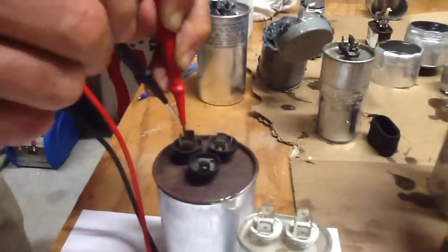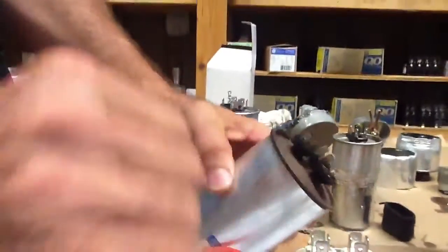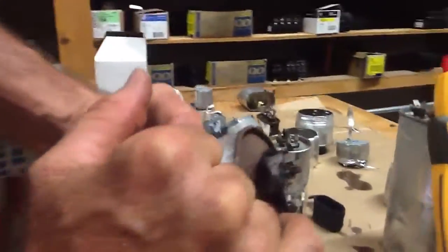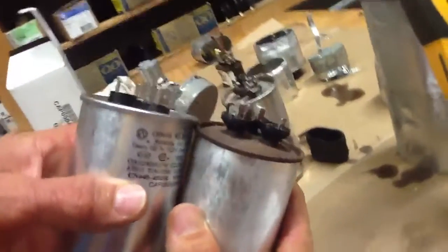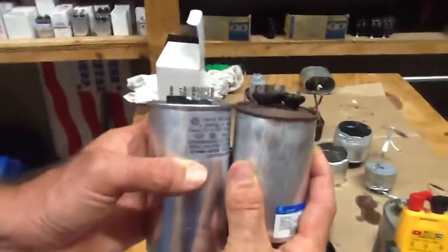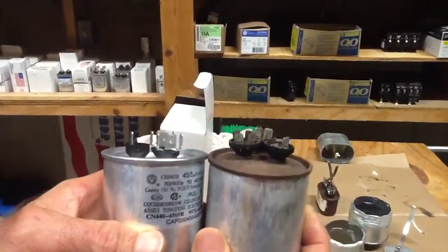Let's just check common to fan. This capacitor is bad also. I want you to point out it's swollen just a little bit — I'm going to do a better video later, but this capacitor is slightly swollen compared to this one. And that's just one of the things you look at when you're a service technician. This would have been flagged as rusted as it is — something you should bring up anyway.